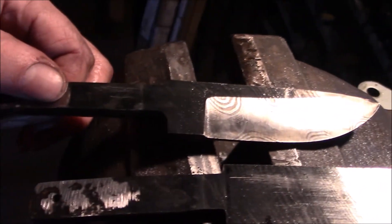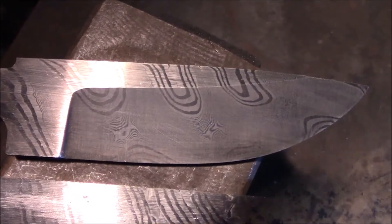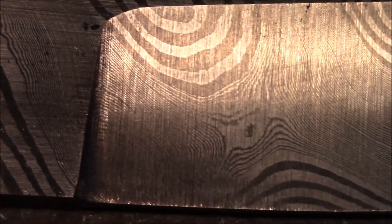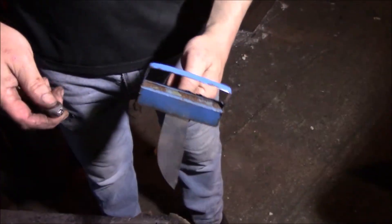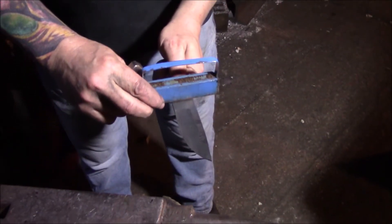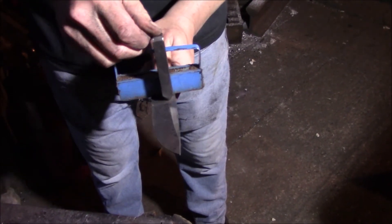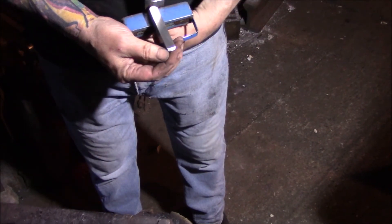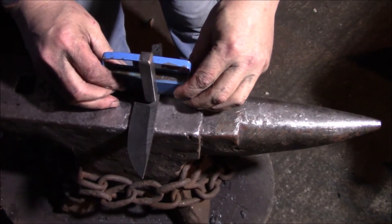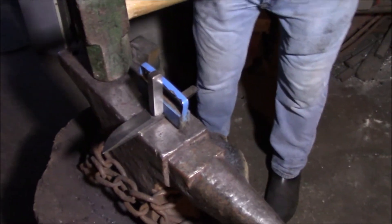You can see a big difference — that's pretty cool, man. Very cool. Okay Wayne, I'll put the touch mark on here. High-tech method — I use this 100-pound magnet, eyeballed as close as I can to square. A couple of degrees isn't going to make a whole lot of difference. I set my stamp down in there nice and square, make sure I'm fairly vertical, and the magnet sort of just pulls down equally the whole way. I get the big hammer — a lot of guys try to do this hot, but I find it's really hard on the knuckles, so I'll hit them cold, and I can straighten anything out after we're done.